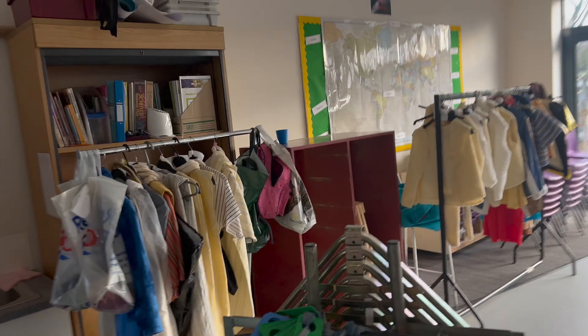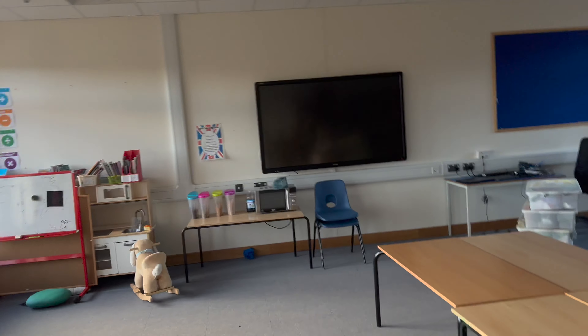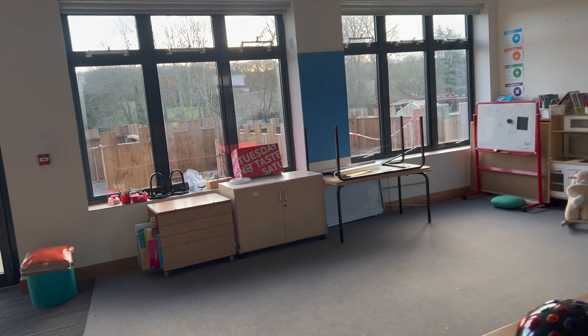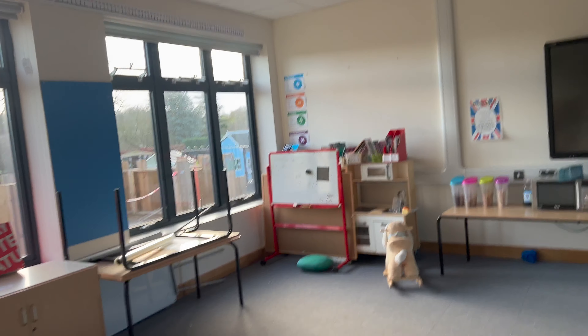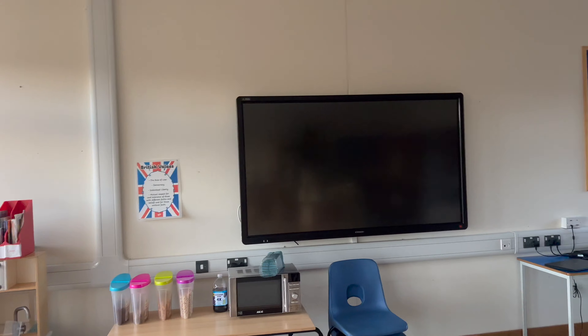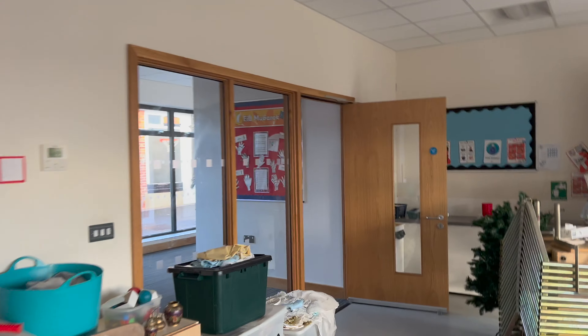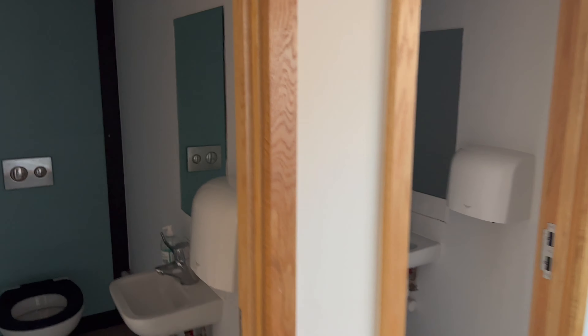It's only us in there — well, and a plumber because there's been a major leak down the other end during the snow, so he's repairing that. What we do is turn off all circuits except the light in the cupboard, then energize the circuit we're looking for, go around each room checking all the points, then isolate it and drop the circuit down. We don't always do the R1+R2 because where it's been energized before and we have the old test results — though I won't show those as they have the previous company's name on them.